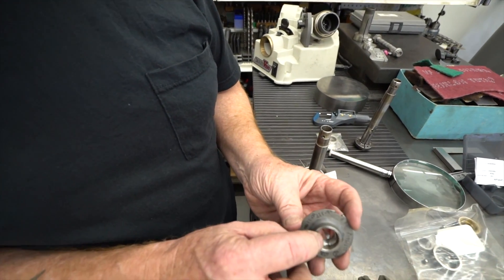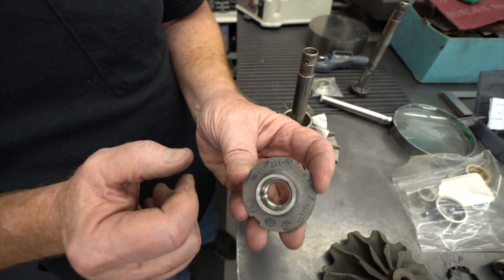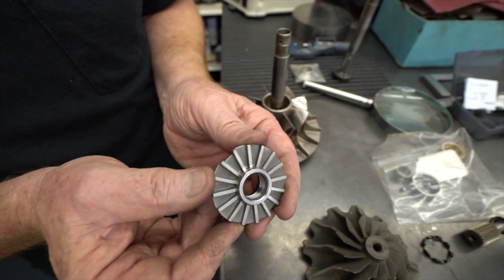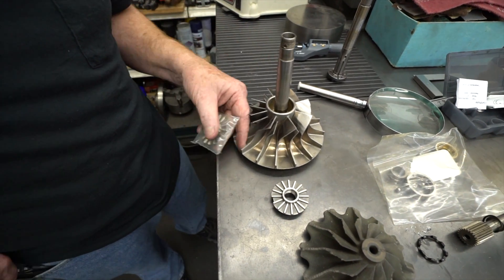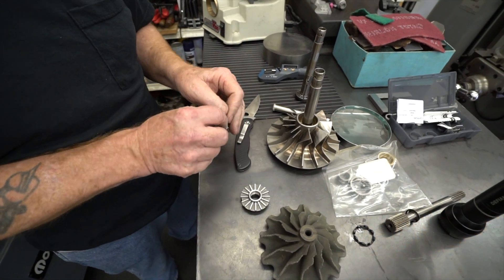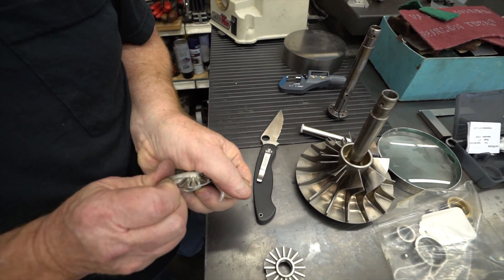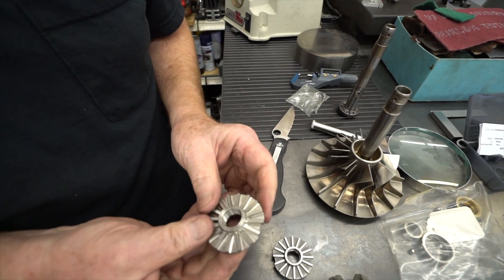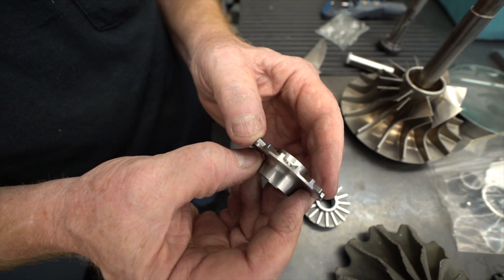As we can see, the stake in this one here went down into the shaft and it forced that cone in the shaft, so I couldn't get good centering. If you look at this side, you'll see the threads are all damaged — this nut is totally not usable. So what we do is we take and make a new nut here. I make all these replacements because you can't get these anywhere. This is kind of an improved one. We've been making them out of 18-8 stainless and 4350 shafting material; we've even tried some with 303 stainless. They're all fully CNC machined, and they're probably better than the originals.